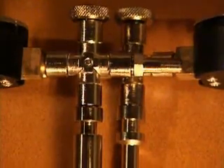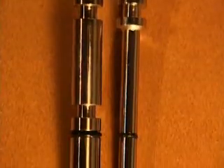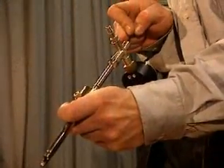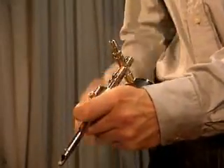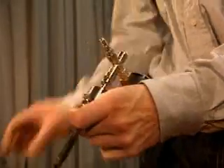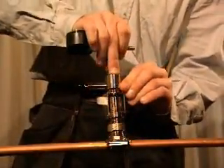The smaller balloon holder is used for smaller pipes. Unlike the bigger one with two grooves, the smaller has only one, and the first position is about halfway into the pipe. Otherwise the procedure is the same as with the bigger balloon holder.